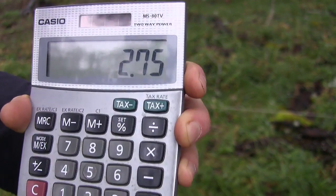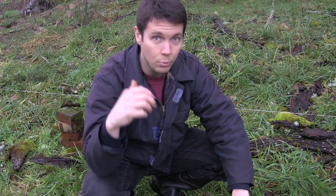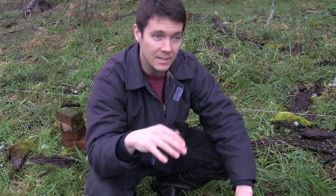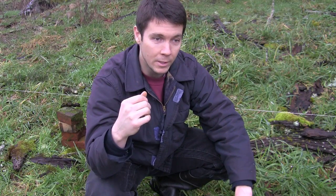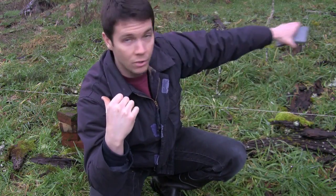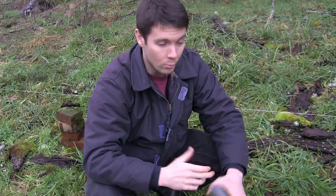I've got two and three quarters feet of drop in elevation. So that answers my question — I feel pretty dang good about that. I can actually run all of that water over there all the way down to the other end, which is on the other side of the property where I don't really have anything going on anyway — it's removed from the house, from the gardens, from everything. In fact, I had considered making a retention pond over there, but I may not have to even get into the expense of that because it is 2.75 feet lower on that end. All I'll have to do is direct the flow of water and I'll be able to eliminate all of this from the side of the property where my gardens, my hoop house and everything else is. It's been an issue for a lot of years and I'm finally to a point where I just need to deal with it.